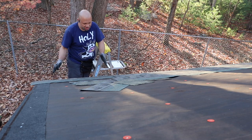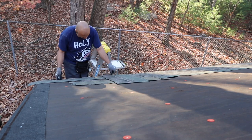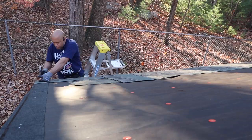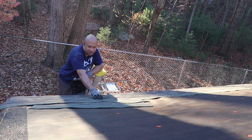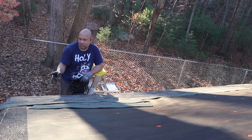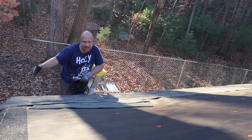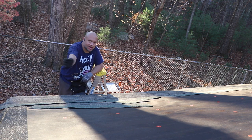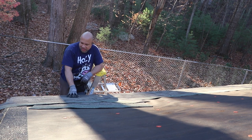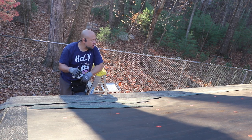The next course is going to be a full course — I'm going to run these all the way down the roof for these four courses and then we'll repeat. When we come to the end there are going to be some partial pieces that we have to make fit, so I'll make a couple of cuts. I did figure out that whatever side you start from, keep that factory edge on the outside and that'll be the prettiest. Since I have five courses nailed down, I should be safer to hang out up on the roof without moving the ladder up and down every time.